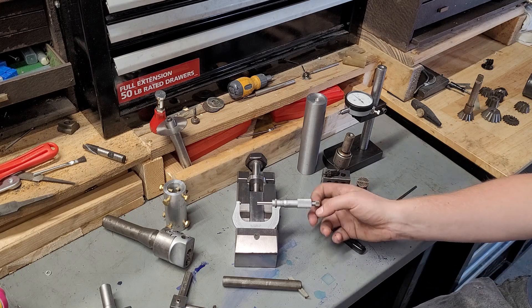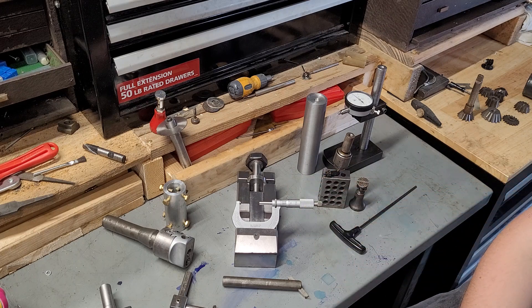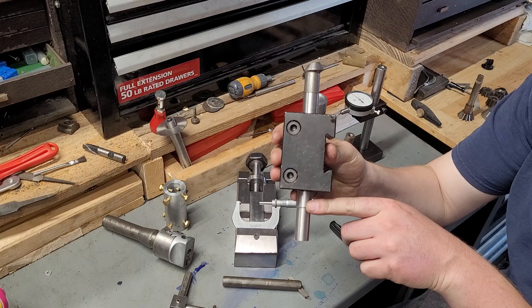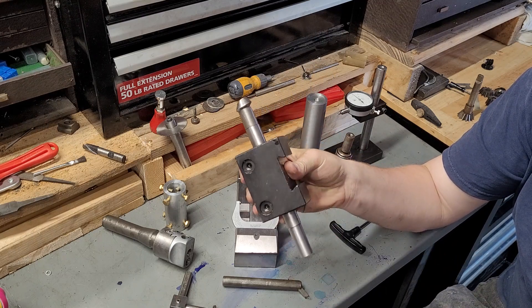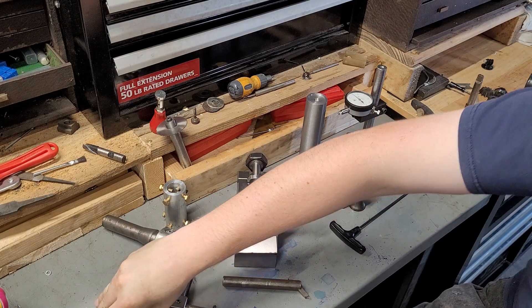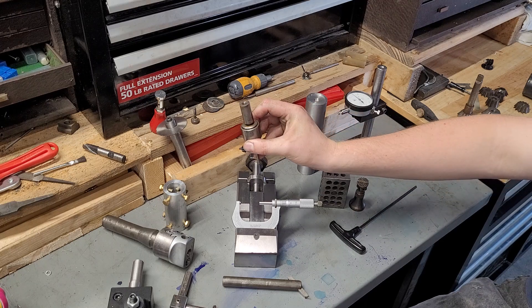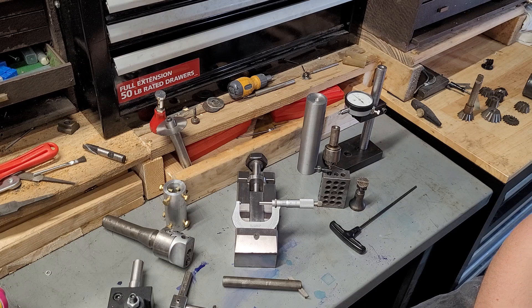Thanks for watching, guys. I hope this inspires especially guys getting started to make more and more complex stuff. As a first project, this type of boring bar shaft is pretty good — you don't necessarily have to do precision threading, but it's good practice turning to diameters and learning how to measure threads. This little Jacobs taper adapter is actually another good one, because you'll have to learn how to do a precision taper. Cutting a precision taper isn't as easy as you think.